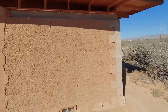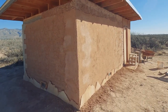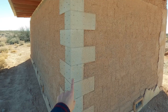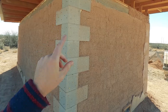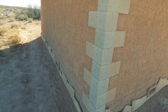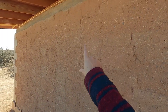We are on the Foxhole Homes property in southern New Mexico. For the past few years I've just been picking away at this project — it's a shed. The structure of the shed is not actually earth; it is concrete. These cinder blocks I've stacked along here are alternated so they could key into the wall going both directions. There's a concrete ring beam all the way around the top and a concrete stem wall covered by this flagstone. The earth wall is in situ adobe — cast-in-place adobe bricks.